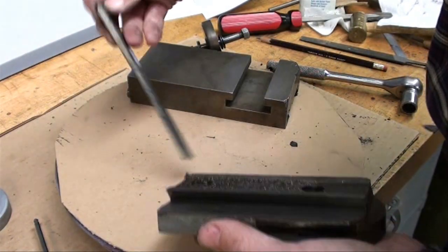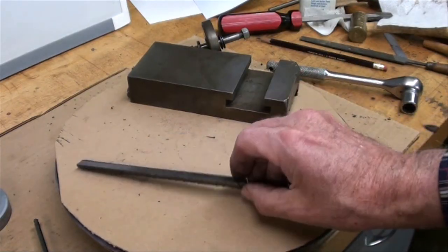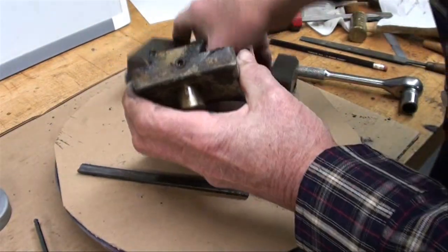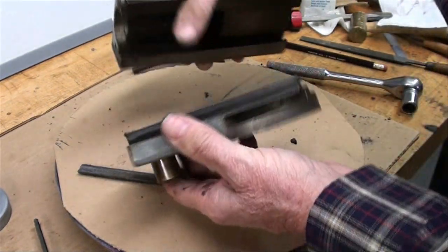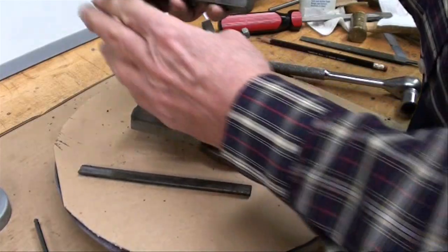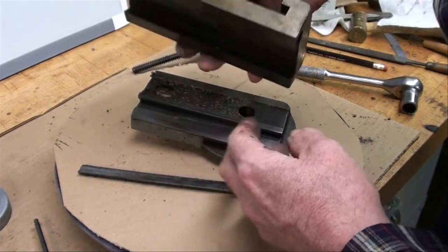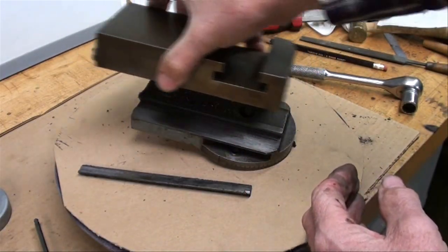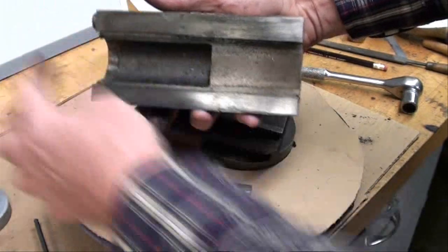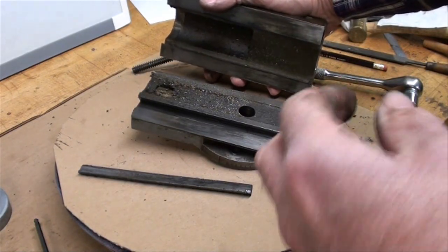Now this should slide so I can take it apart. The gib dropped out — can you tell that it's tapered? That'll have to be cleaned up real good; a lot of chips in there on the dovetail. This of course is the dovetail mated with that dovetail. Remember that on these machine slides, the actual sliding surfaces are here and here, mating with each other — that's what gives you your accuracy. The gib is simply changing the pressure between those two surfaces. This is where we really need oil, and sometimes when we oil a machine we're squirting it in various places and not getting it right down where it's needed.